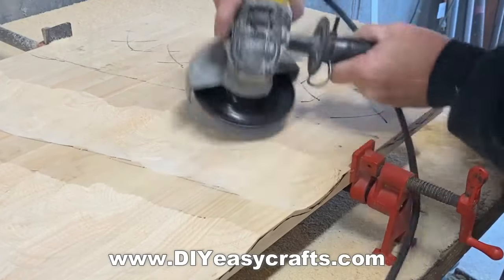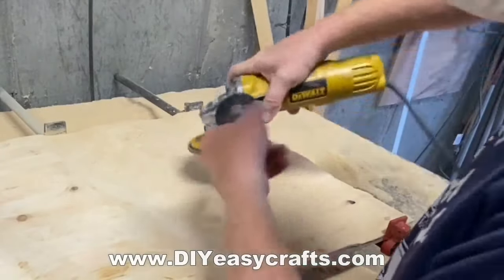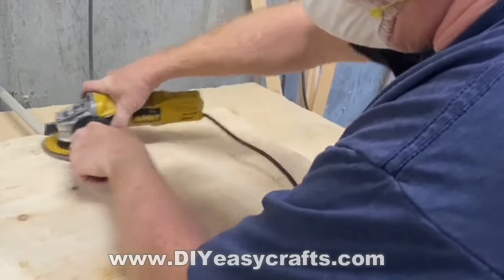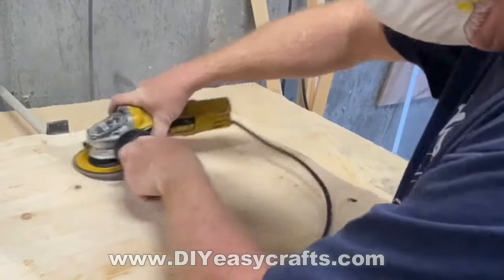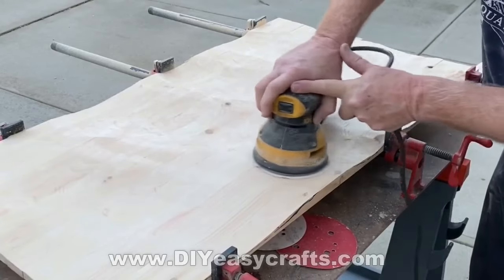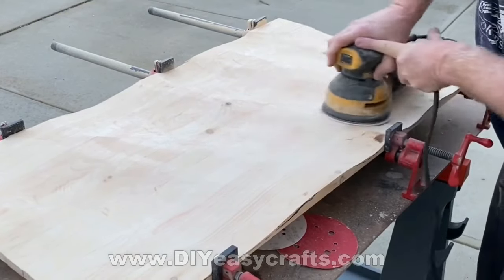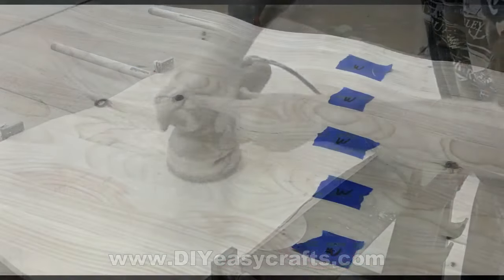And then I'm just going to go back over the same area with a regular standard flap sanding wheel. This is an 80 grit, just to smooth out all of those coarse grind lines. And the end result here is you don't want any flats at all. You want it to curve right from the bottom of the groove, over the top and into the next groove, all curves. And then the final step is going to use an 80 and then 120 grit paper on an oscillating sander. The 80 grit was pretty quick. Most of the real deep grooves I had removed with the flap sanding wheel.